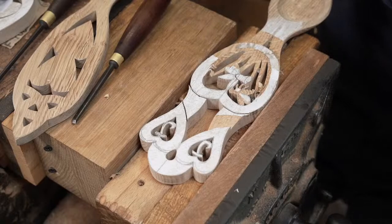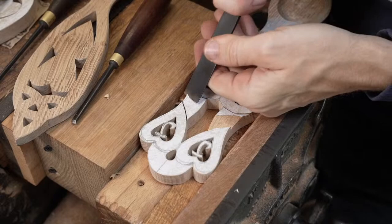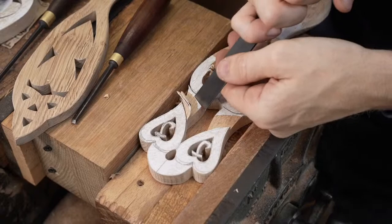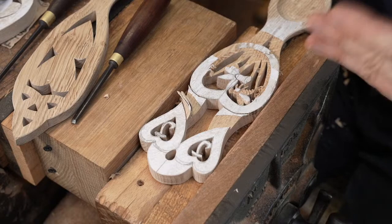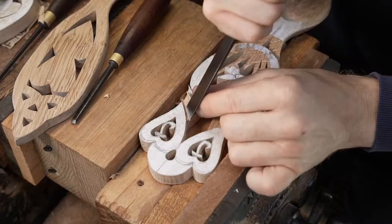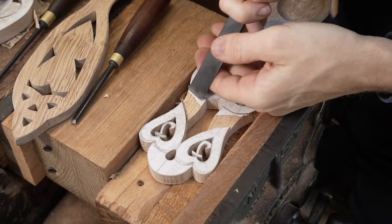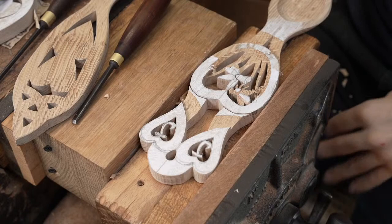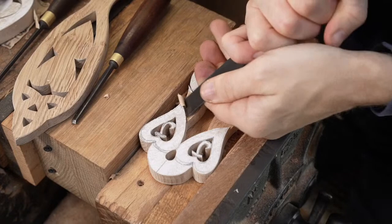And that's maple mostly. But that's interesting, because maple is actually a timber that you don't like carving, isn't it? You find that maple a bit hard. Yeah, I'm getting a bit old now. I find it a bit hard. And maple's really nice. It's a really pure color, pure finish you get on it. However, it's physically quite demanding, because it is hard stuff. And also, if you get any tiny little nicks in your gouges, in your tools, doesn't that show up? It shows everything because it's that paler colour. So there are a few challenging bits when it comes to using maple.